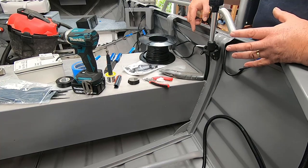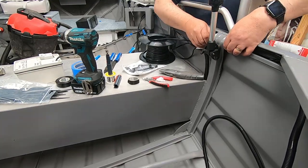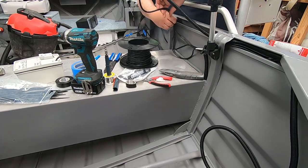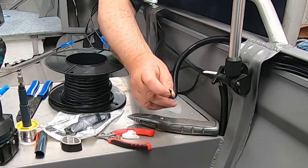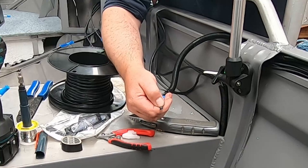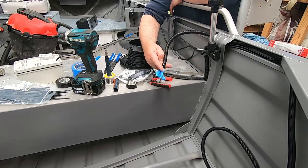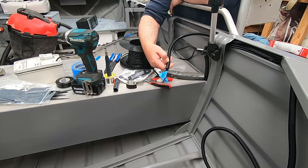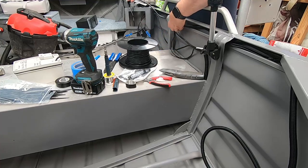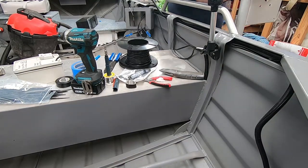Most of these wires won't be active while I'm sounding anyway, so it's just a matter of threading it through. These gunnels on the boat here are quite handy for that. All these cables are double insulated — each wire inside has insulation, and on the outside there's another layer around both the twin cables. You could run them straight down the side of the boat — the outer conduit just helps with vibration. And it gives the spiders somewhere to live, which freaks you out when they fall out while you're fishing. They're only Australian spiders — not like they're poisonous or anything.